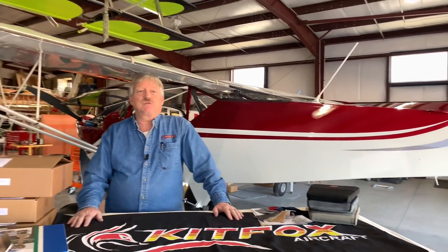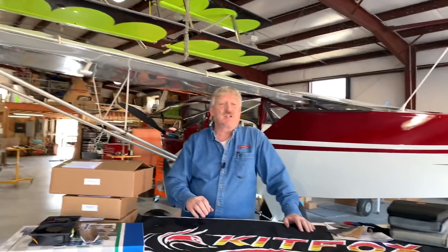Next up is the builder's tool kit. We get asked a lot: are there any special tools needed to build a Kit Fox? "Special tools" is a broad spectrum — a cleco is a special tool to some people; it's used throughout sheet metal applications, but you may not have done sheet metal before. Special fixtures: you can actually cover the fuselage and the wings without special fixtures using sawhorses. It's nice to have a couple of turn fixtures — we use them here frequently where we're building many.